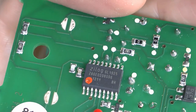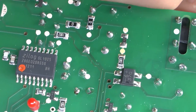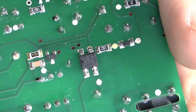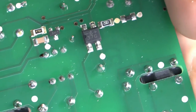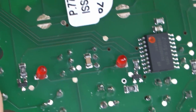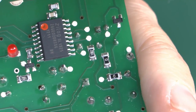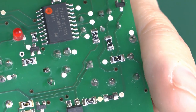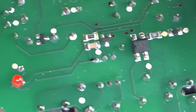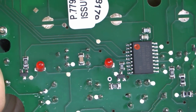That component is presumably just a bridge rectifier - it's got plus and minus on one side. The rest of the components on this side include what may be a transistor or two, a few capacitors and resistors, and another transistor next to that. The components with a zero on them are just links - zero ohms obviously. Not a whole lot else on this side apart from a couple of connectors, so other than the main chip, not really much on this side doing anything.